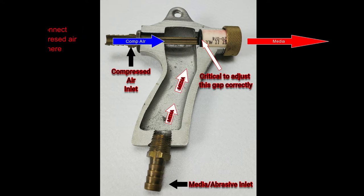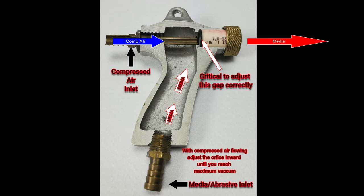The vacuum created pulls media from the media source, whether that be a sump or reclaim, and projects it through the nozzle into the blast area and onto your substrate. As you blast, the nozzle wears, creating a larger opening or orifice in the blast nozzle. This larger opening creates less vacuum, which in turn will pull less media into the airstream. Keeping the nozzle orifice new is critical to operating your Blast-It-All Suction Blast Cabin.